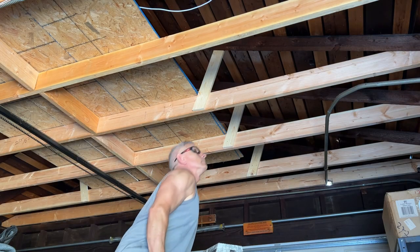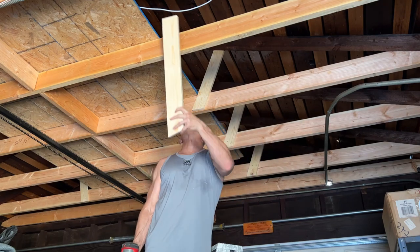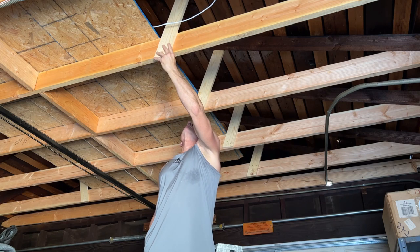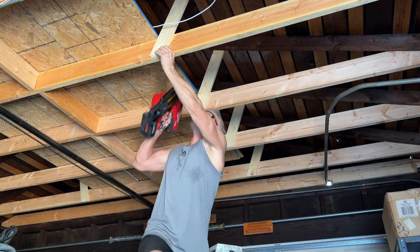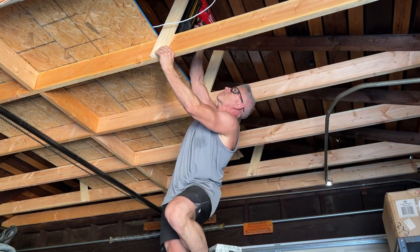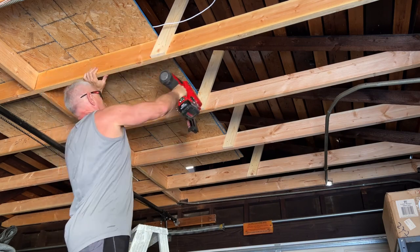As you can see, I managed to get the plywood up there after I cut it down. Now I'm installing the last step — adding legs between the roof rafters and the ceiling joists I just installed. This is going to give a lot of stability to the ceiling framing system, and now it's going to be supported from both the walls and the actual rafters.